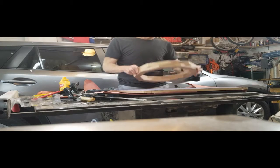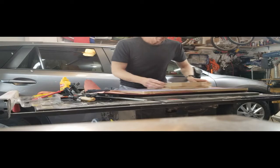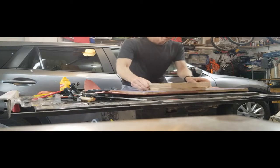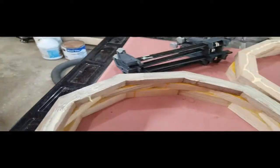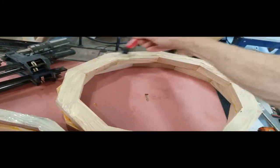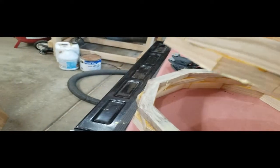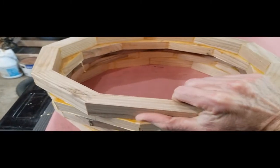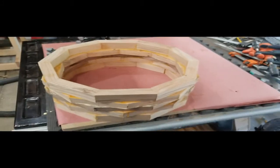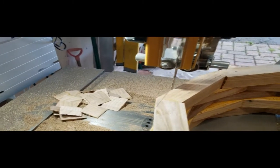In a moment you'll see the other two layers that I glued separately. Those are now ready to be joined, but first I'm using my sanding board — which I usually use on the edge of stave drum shells — to get nice even gluing surfaces. Going into high speed mode here to relieve the boredom. Same deal: glue both sides, line it up so that the end-to-end joints are staggered.